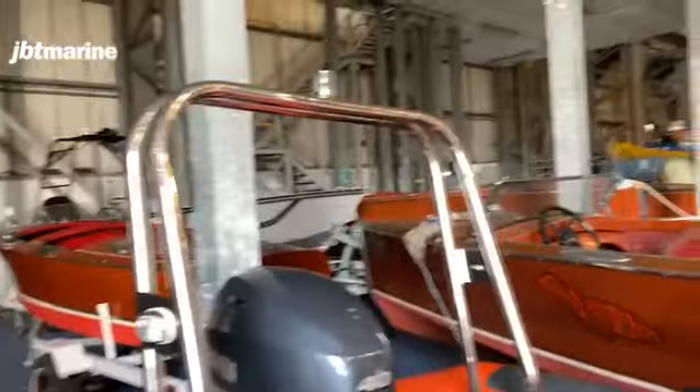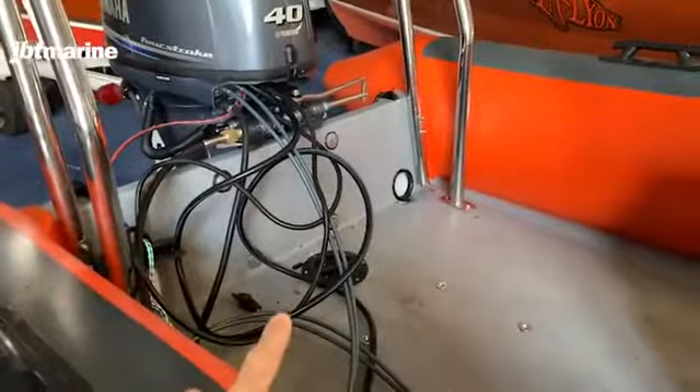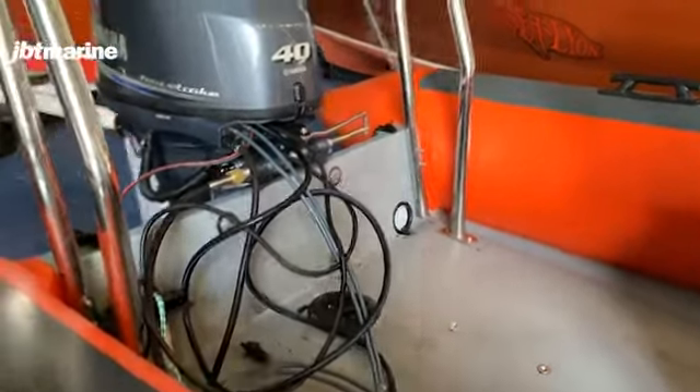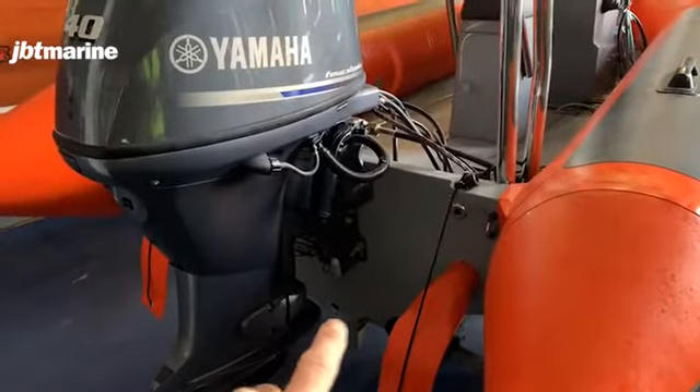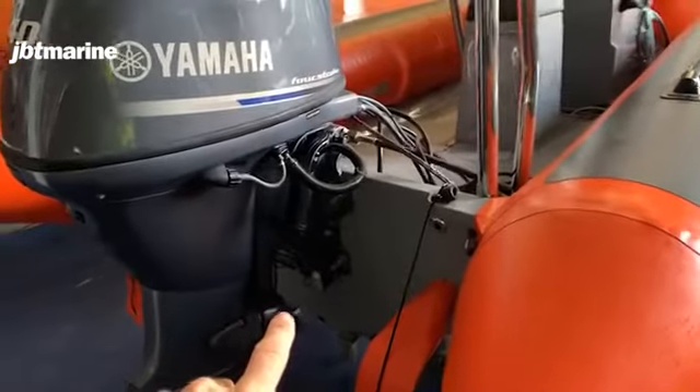The boat has got the double A-frame here. It has a bilge pump in there, the deck drains through elephant trunks, and a higher transom height so water coming into the back will be minimal at best. It has a drain bung here so when you are recovering you can get all the water out of the hull, and load points through here, with drains from the deck down to the bilge if you need it.